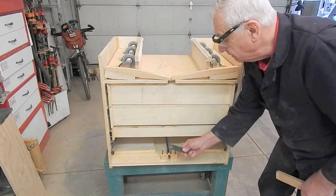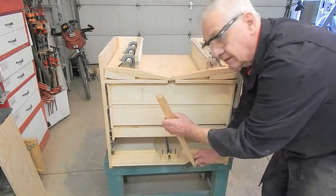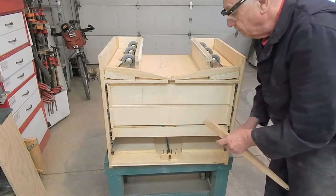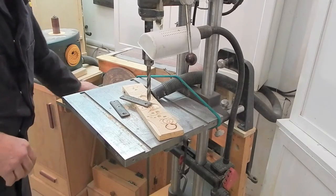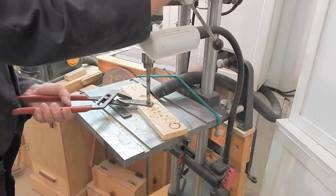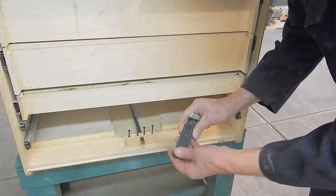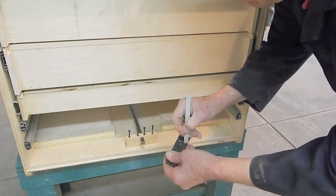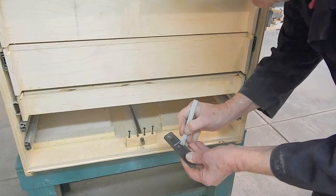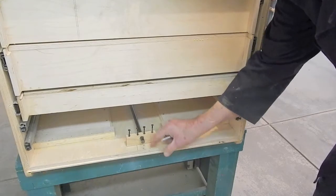1 1/4 inch by 1/8 inch steel, and I'm going to drill a hole for the half inch rod and a hole for a through bolt to the push rod and come up with a way of attaching this arm to the rock shaft without welding. I need to drill a half inch hole in one end of these straps. These two straps together with a half inch bolt to keep things lined up. I'm going to cut it off beyond this bolt which connects to the connecting rod, and I need to taper the point so it can rotate down close to the top surface of the cabinet.